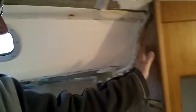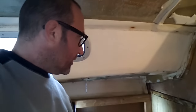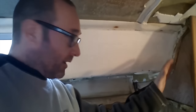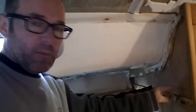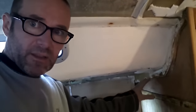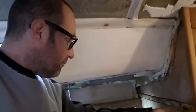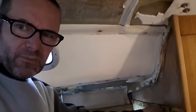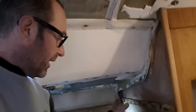I made a cardboard template which had the shape to go up inside here where there are two flanges, or the deck moulding where they meet. The wood goes up inside there, and the first piece comes down and sits on top of the bulkhead — that's the filler piece. Then the piece on the outside jams up inside there with lots of thickened epoxy, and I've routed a quarter-inch slot rebate on there which the board sits into, so the second piece sits flush on the outside.